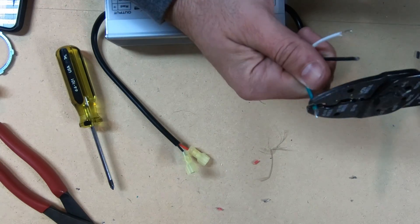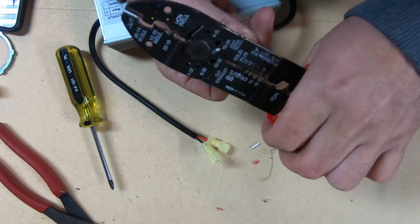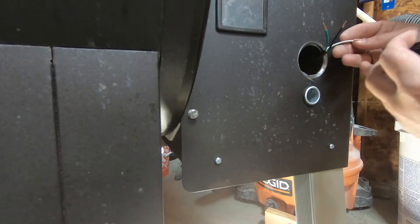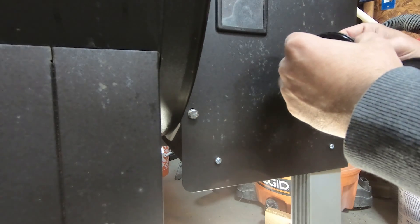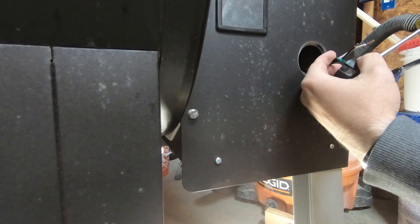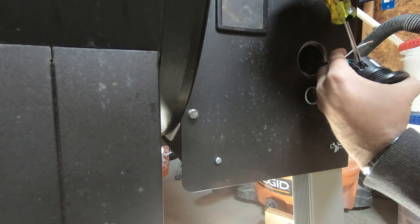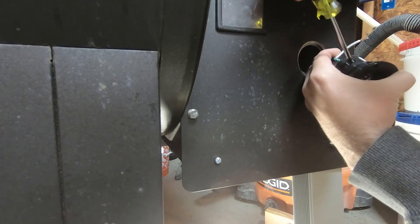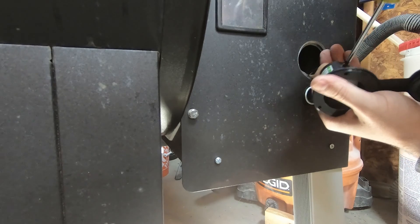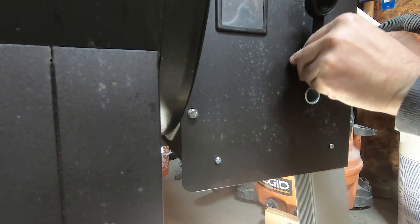On the input side, all we have to do is strip these wires back. I snip off the soldered ends that come from the factory and then strip it back about a half inch to some bare wire. The fastener on the receptacle is what's gonna hold them in. So here's the receptacle — again, white is white, green is green, black is black. You just insert your wires into the back side of the receptacle and use a screwdriver to tighten them down. I have the inverter just kind of hanging in the back there in place while I stick this in. I use number 10 screws with a lock nut and washer on the back — that's what's gonna hold the inverter in place underneath the grill. Just tighten the wires down, slide the receptacle in place, tighten down the castle nut on the back, and you're done mounting the receptacle.